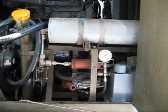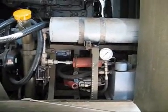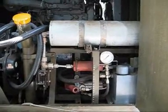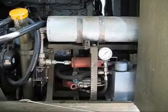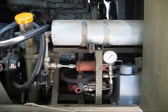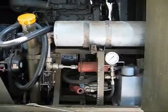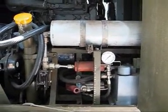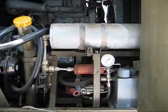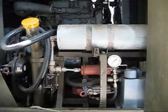The generator is equipped with a hydraulic starter for when the batteries are low, but you do need to have some power in the batteries as the relays need to engage before you spin the hydraulic starter. The hydraulic pump needs about 20 to 30 strokes of the lever to go up to sufficient pressure to start the generator. We'll be showing you how to start it on hydraulics right now.